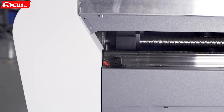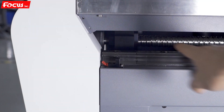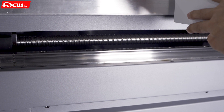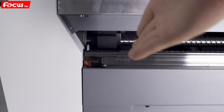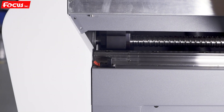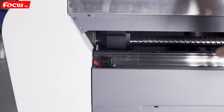When we go to the right side of the machine, we can see the front limit sensor. When the sensor is triggered by the metal installed at the bottom of the slide, the table will stop moving forward. This is the front limit sensor. Inside there is also the ball screw and linear rail for the Y-axis.